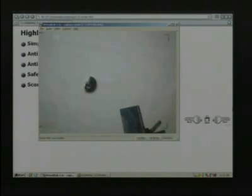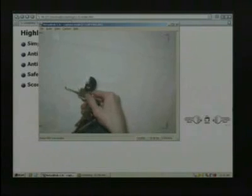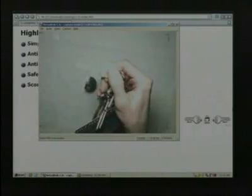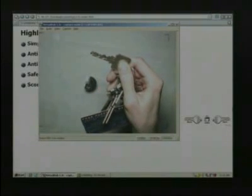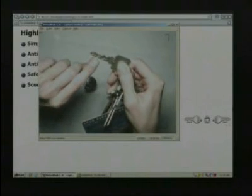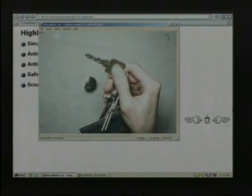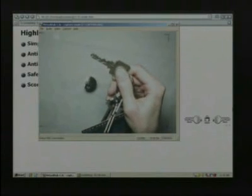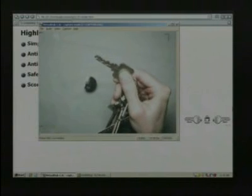No, this is not actually my house key. I'm not that dumb. But it's a good size key. It's a restricted blank, meaning no Joe Schmo can just walk into a Home Depot and get a blank for this. But you also see that there's this little worm cut in the side here. What that does is it interacts with a sidebar inside the lock, lifting pins up into the right spot so that the bar can fall in.